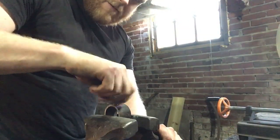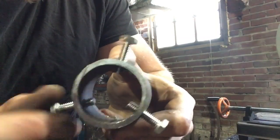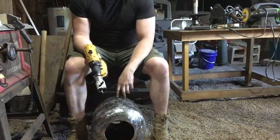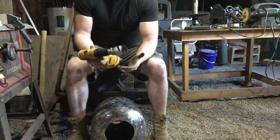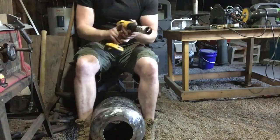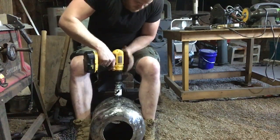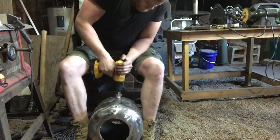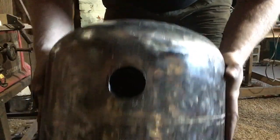Your bolt should go right in. That's just a close-up of the finished project so you can see the idea of what's going to be holding the burners in the forge steady. Next thing we're going to get the holes for the burner ports drilled in the forge body. I'm using an inch and three-quarter hole saw to do this. It's a bit tricky to drill through something round with a hole saw, but it's definitely doable if you go slow and pay attention. Best way I found is to sit on something and hold it between your feet — I'm sitting on my trusty sanding stool, which consists of two anvils. I've already got a pilot hole drilled. Like I said, it's a bit tricky with a hole saw but it's definitely possible.